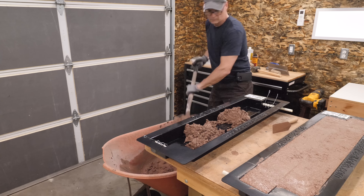I'll leave these fresh castings wrapped in plastic in my warm shop to cure for a few weeks, periodically wetting them down with water so they don't dry out while curing. This will give me the strongest panels.